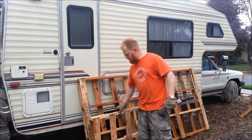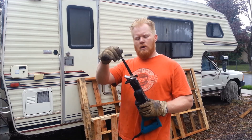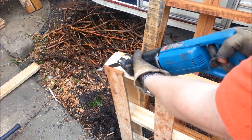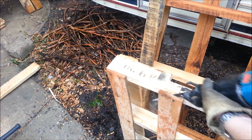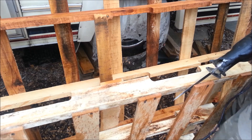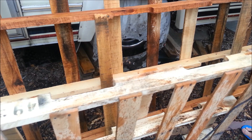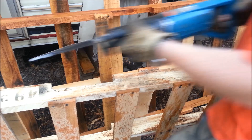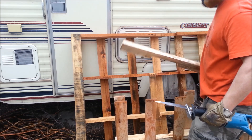But the sawzall — let me show you. We're going to use a long sawzall blade; this one's probably about 10 inches. You want longer, the better. This is an all-purpose blade that cuts through nails, cuts through wood, and everything in between. I'm just going to get it right up in between. Done. There we go — board's out.